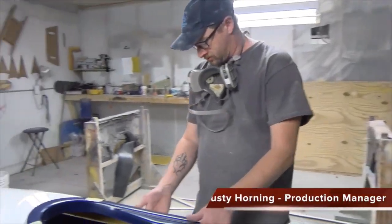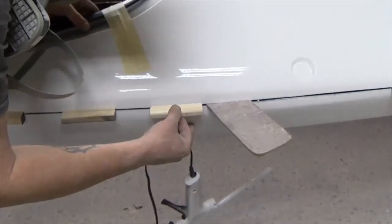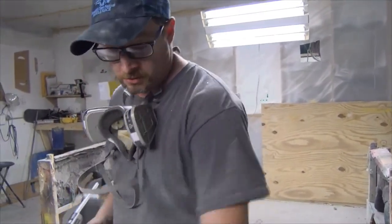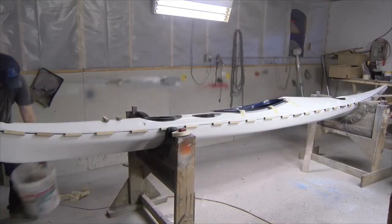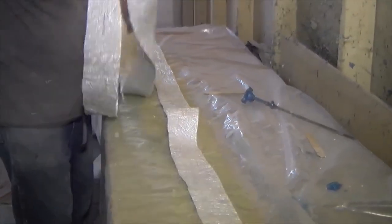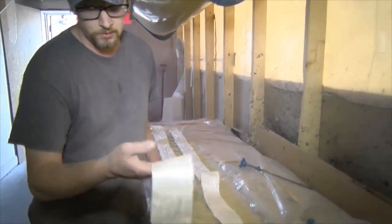We have it set together. Now we're at the point we call blocking. We're going to take all these wooden blocks with a little bit of hot glue and glue the deck and the hull together. What that does is it helps shape the boat, set the sheer of the boat, and then I can put my inside seam on the inside and that holds the whole boat together. The inside seam is nine-ounce bi-weave on the outside with a layer of chop mat on the inside. The chop mat gives it superior adhesion and means we don't have to use as much resin. This is what holds the boat together.